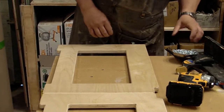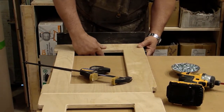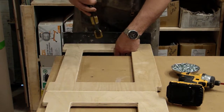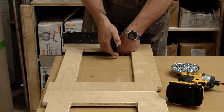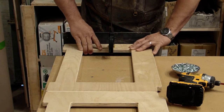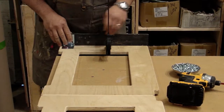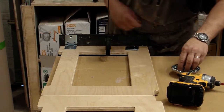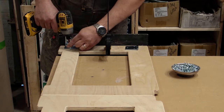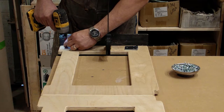Now the hinges — I line them up with the actual webbing, like the top and bottom stretcher there. As long as it's lined up there and it's further away than three-quarters of an inch from the top edge, it won't interfere with the blocks. But if you put the hinges in and they're not more than three-quarters of an inch in, those blocks from the top will knock up against the hinge. So aside from that, you have room to play with, which is why I'm not jigging — this is more than three-quarters of an inch and it's lined up.